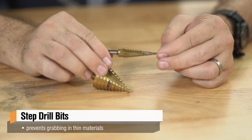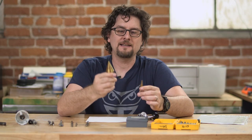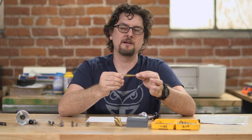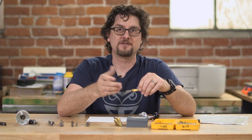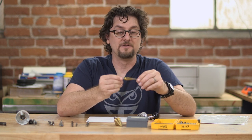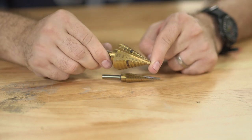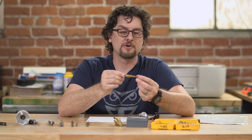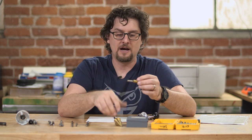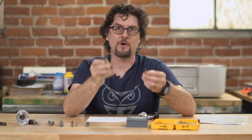Next, my favorite drill bits of all — these step bits. I've been using these more and more. You can get them in lots of different sizes, from this fine smaller set to this big fatty. What they allow you to do is progressively drill a hole and step it bigger and bigger. One of my favorite uses is in materials that tend to grab with twist bits, such as sheet metal or plastics which might chip or break — like acrylics. Step bits work really well for them. They're also good if you just need to make a hole just a little bit bigger. The problem with step bits is that you are restricted by how tall the step is, so if your material is taller than each step, this isn't going to work — although you can get step bits with a taller step. I use these all the time, particularly when I don't want the bit to grab or chip the material.